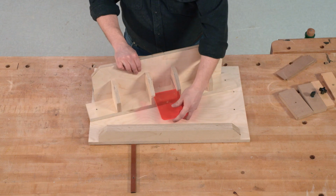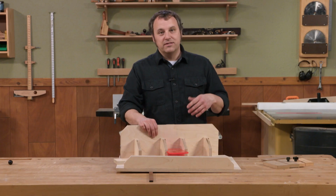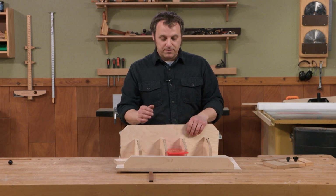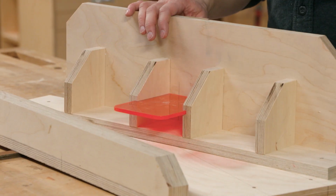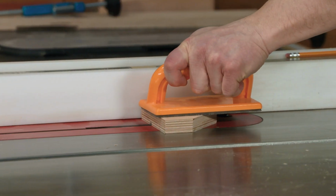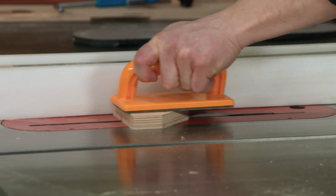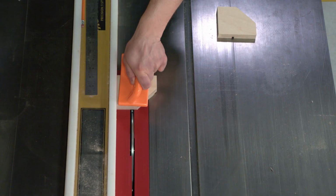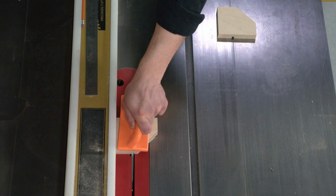In the middle of cutting, the last thing that you want to do is to end up having an accident and accidentally cutting one of your fingers. So the blade cover is just a physical and a visual reminder to keep your hands away. And I did that just using a dado blade and making sure, because you're creating 2 mirror image pieces here, that you have the dado lining up with each other.